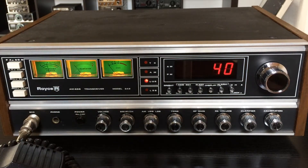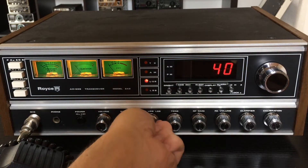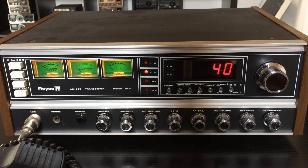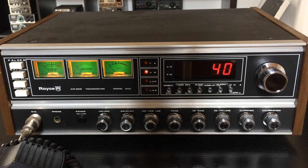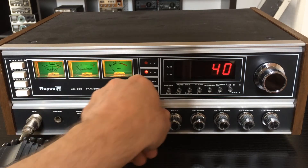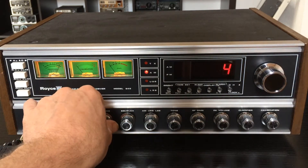I will start the radio here on channel 40. You can hear the noise — see the S-meter here on S7. This is PLC — powerline communications interference. Here in Switzerland we don't have a chance to fix this problem. Now I will look at AM. This morning you can see an FM carrier here.